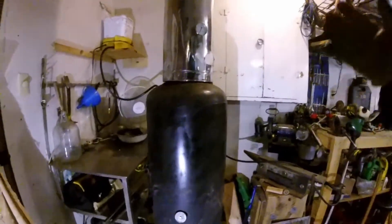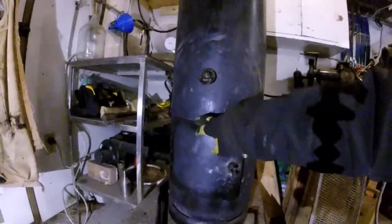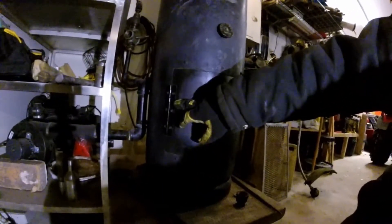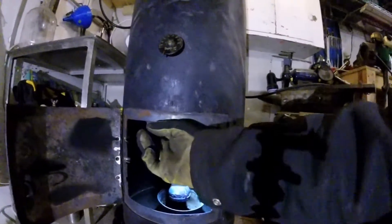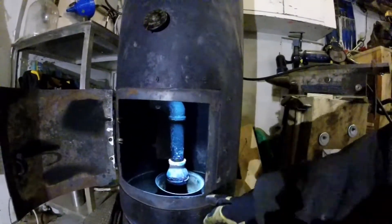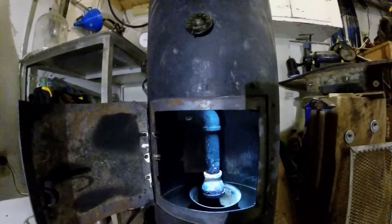In order to do that, we emptied it out and filled it full of water. While it was full of water, I ground a door out of it. I did one side, drilled it out, and put the hinges on so I could cut out the rest of it and open it up. I took some flat stock, bent it to shape, drilled it out, and just bolted it on. I did have a friend weld my gaps while it was in place, and also welded the top.